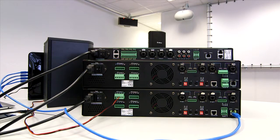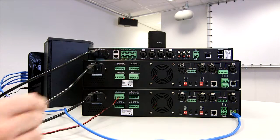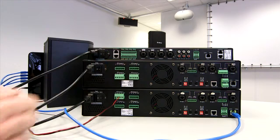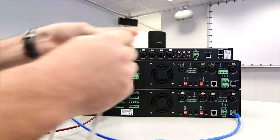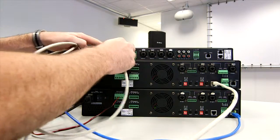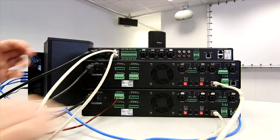As the name suggests, Amplink links the amplifiers to the DSP processor quickly and easily. Eight channels — each one of these units would need to be wire-stripped, twisted, probably tinned, and screwed into a connector three times for balanced audio. Or you can use a much simpler method: click to click, here to the bottom amplifier.